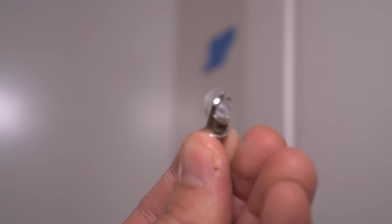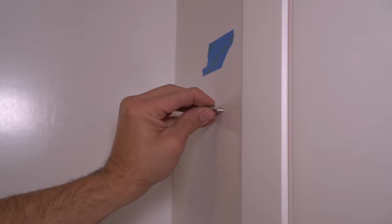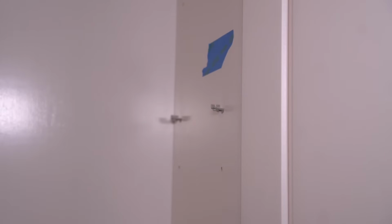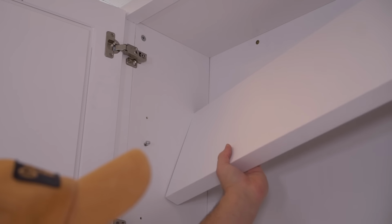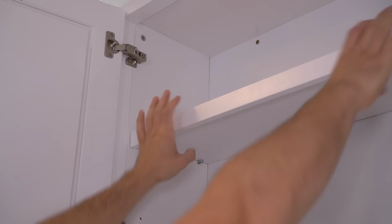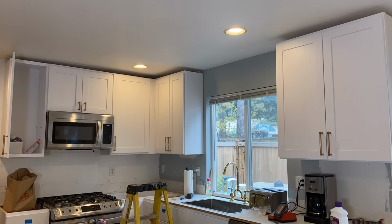With most kitchens, including this one, your shelves are just going to be supported with a shelf support pin like these. They're extremely easy to adjust and position each shelf at the exact location that you want. Just make sure all 4 of the pins are at the same height. You may need to finagle the shelf in there a bit in order to get the shelf in place with the pins already in place, but with a little wiggle and shimmy, you're able to get it done. Once all of our shelving is taken care of and in place, I can proceed to our paneling.